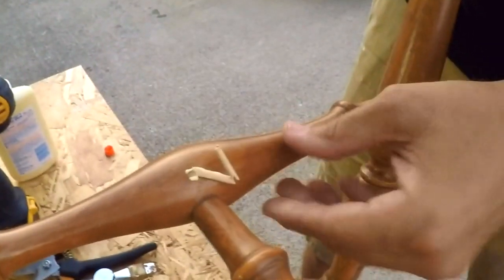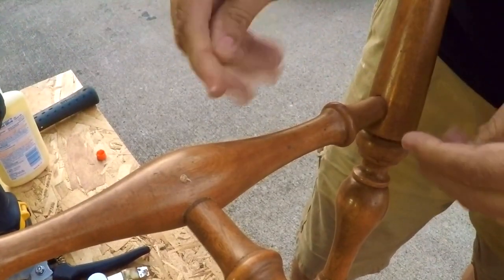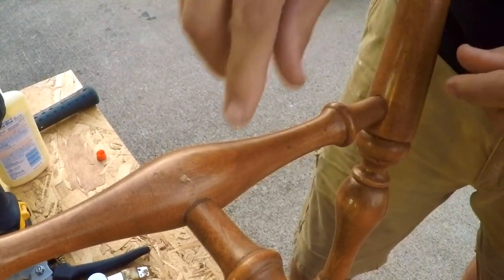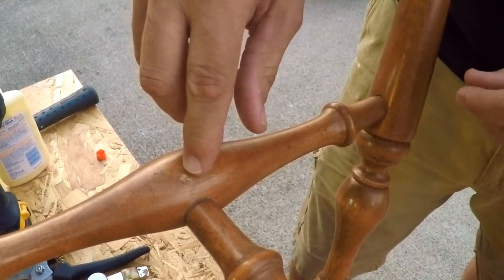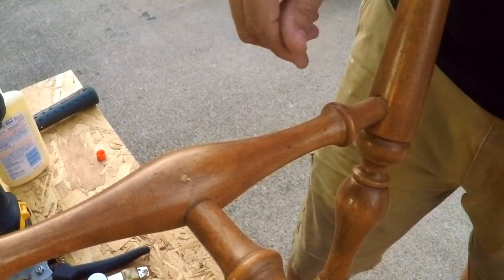As you get there, the dowel just breaks off. I think that's pretty smooth as is, so we're going to leave it at that. Now we've got a permanent repair, and that little trunnel or peg is going to hold these two pieces from ever coming apart again. I hope this video helped — it's a five-minute repair and it'll last for quite a long time. Thanks a lot for viewing, and we'll see you next time.